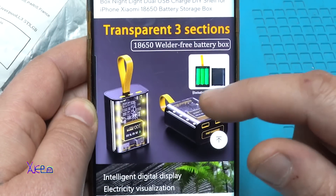As I said, it's a DIY power bank — it doesn't come with batteries. You need three 18650 lithium batteries to be placed right here. I have already prepared three pieces. These are pulled out from an old laptop; they are in good shape, 2000 milliamps each.